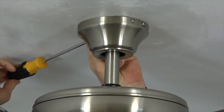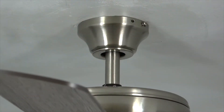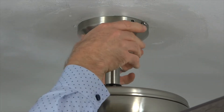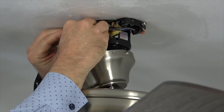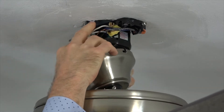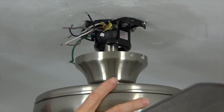Make sure the power is turned off at the breaker box before starting the installation. If installing the receiver in an existing ceiling fan, you'll need to remove the canopy and disconnect the fan wiring. The canopy is typically held in place using screws around the upper edge or screws at the bottom underneath a decorative ring. Use a screwdriver to remove the necessary screws, remove the canopy to expose the wiring, then disconnect the fan wiring from the house wiring. Once the wiring is disconnected, lift the fan out of the mounting bracket and gently set it down.